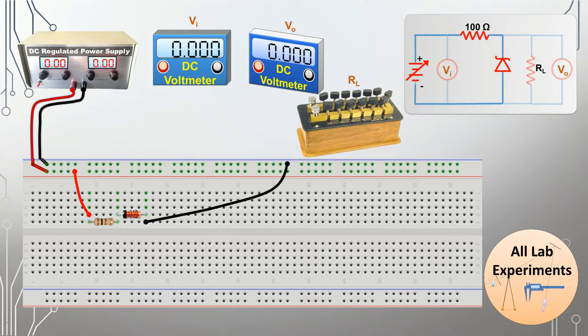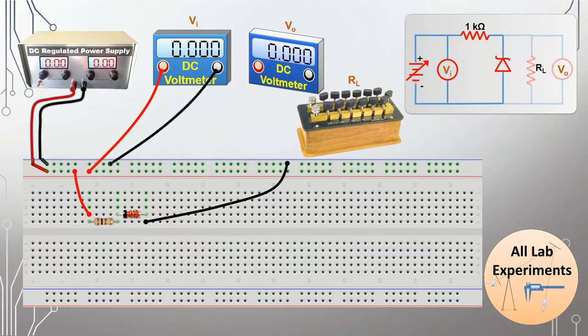If we look at our circuit diagram carefully, we will find that the voltmeter for input voltage VI is in parallel to the variable power supply. So we can connect the positive of the voltmeter with the positive and the negative of the voltmeter with the negative of the power supply to measure the applied voltage. In some cases, when you have a regulated power supply, they also have inbuilt voltmeters, so in those cases you can skip this voltmeter and use the voltage reading given by the regulated power supply.